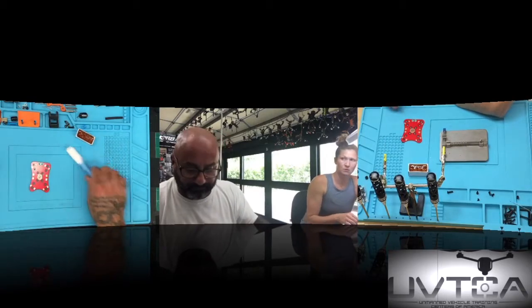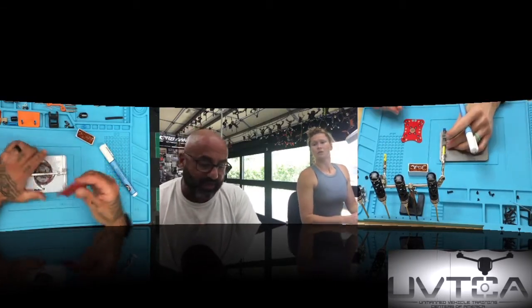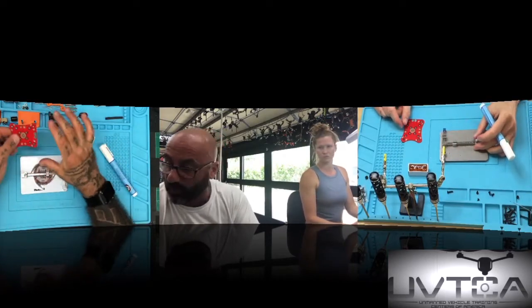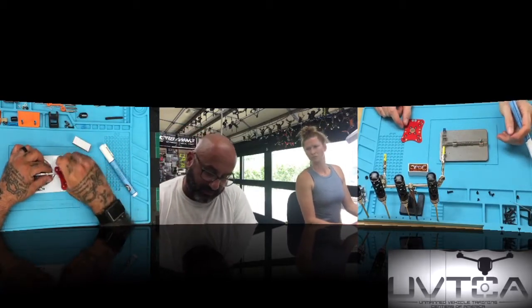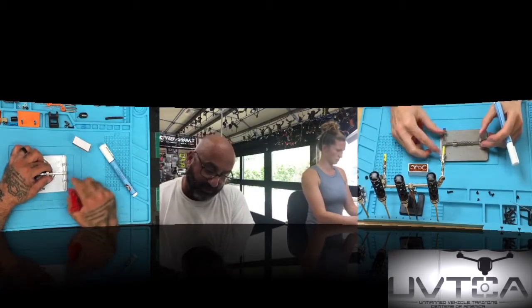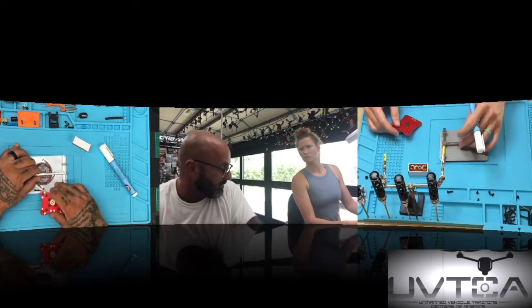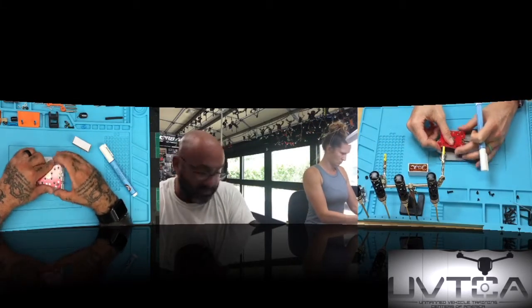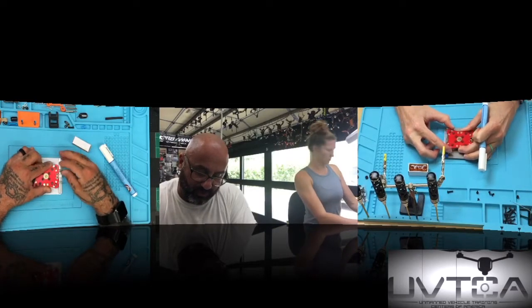Okay, so to prevent these from sliding around, you can use something like these holders. There's a good and bad to these holders. The good thing is, when you've got something like this that doesn't have components in the way, you can just keep it unscrewed, and then slide these somewhere, because they've got little grooves in them. So you're gonna basically pull back on the spring, put your board in that groove right there, and then push it all the way back and bring those sliders in to where this board goes into those grooves.